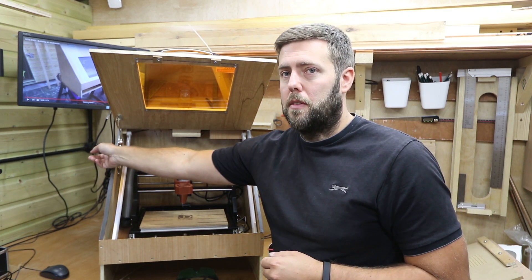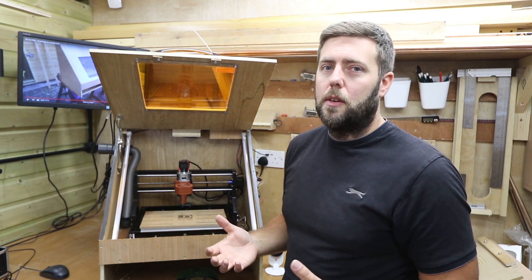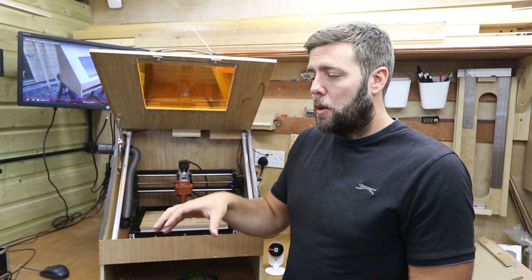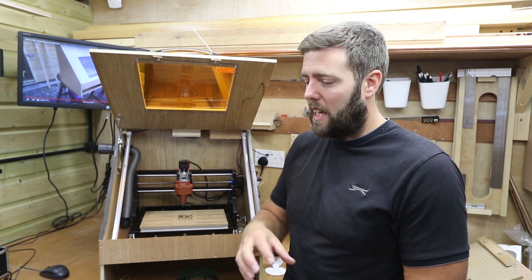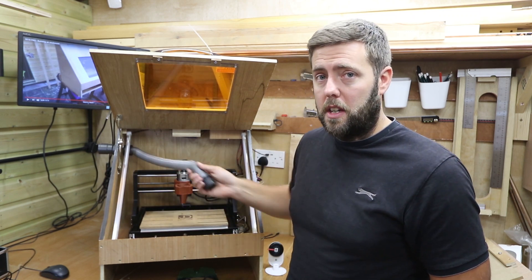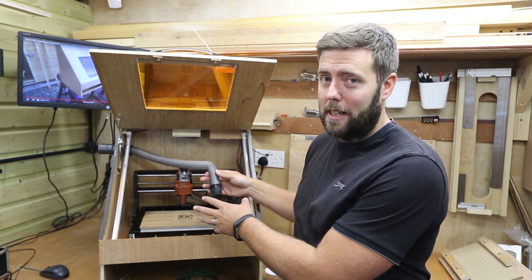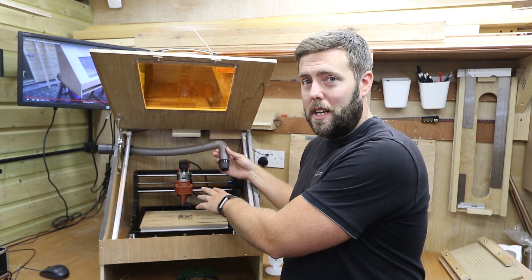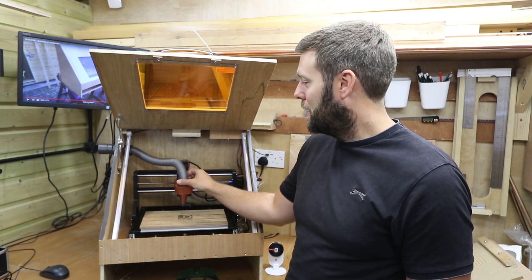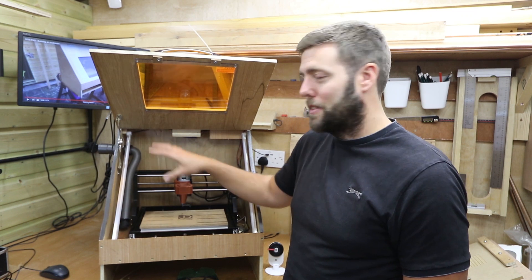You'll also notice there's a port on that side and a hose coming down. When you build an enclosure it's typically to contain noise and dust, but I still wanted the facility to extract dust while the machine was running, because if you're doing a long job there's a big build-up of dust and it does hinder the cutting process. This is basically just a spare Dyson hose — they're springy and flexible, making them the perfect accessory for dust extraction within an enclosure. I already have a dust shoe and this just connects perfectly to the top, so as the x-axis goes back and forth the hose simply follows.